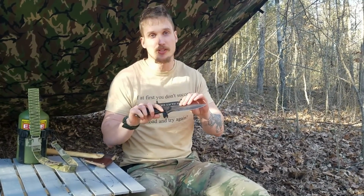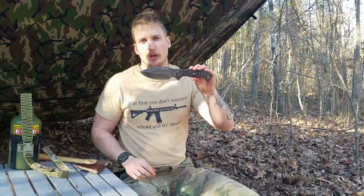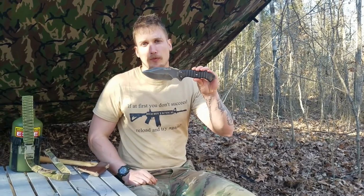If you had a proper flat grind coming up on this blade, another 2 inches of blade length, and a decent steel, do 1095 with Rowan heat treat. 1080, 1080 plus, 1084, 1070 would be more appropriate. If you did that, this would be a great survival one-tool option knife. Ideally more like 3 extra inches or 4.